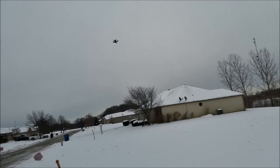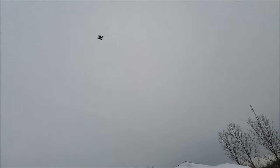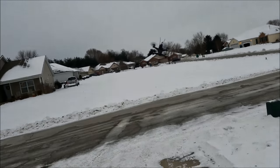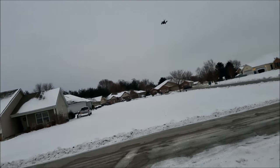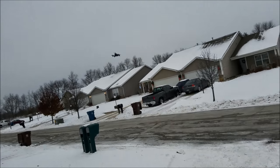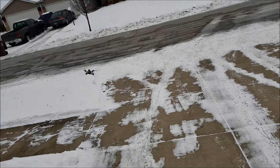It has a low voltage warning buzzer built in, and it does have a failsafe. It is a little long unfortunately — like the F210, it's about eight seconds before the failsafe kicks in and it'll drop, so if you lose signal and a fly-away happens, it is eight seconds. But the buzzer does help you find it. I'm getting really short flight times, but it feels like seven degrees out here, so that could be the reason.